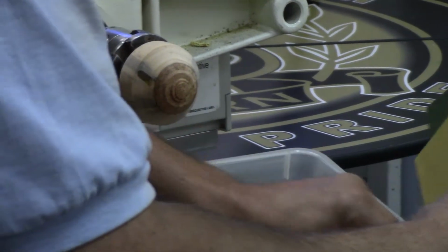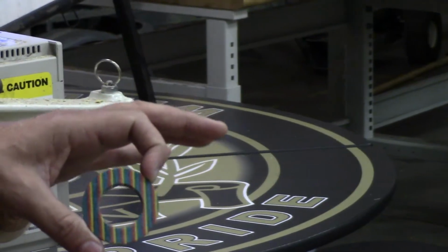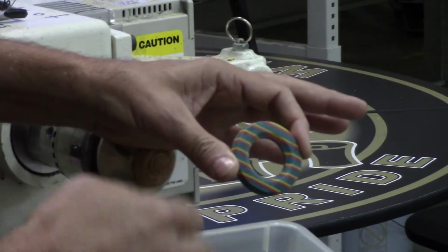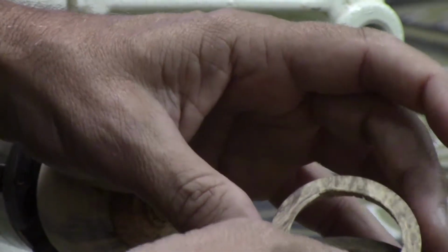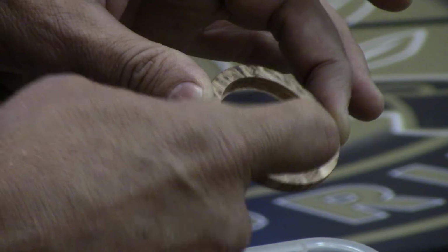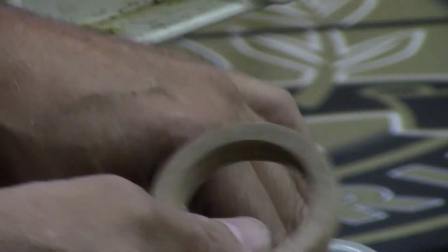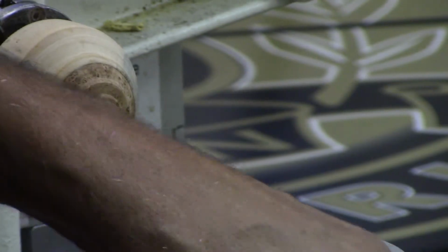You can also use plainer woods too. Like here's a ring of rainbow spectre ply left over from a birdhouse I did. And that can go as a stack layer or a top. There's a nice piece of eucalyptus burl, which is a rim. I can stack that up in the center. You have to be careful about gluing it and cutting it to leave enough thickness. And that's just a piece of camphor. You can use any of these on these bowls. It just takes a little planning.